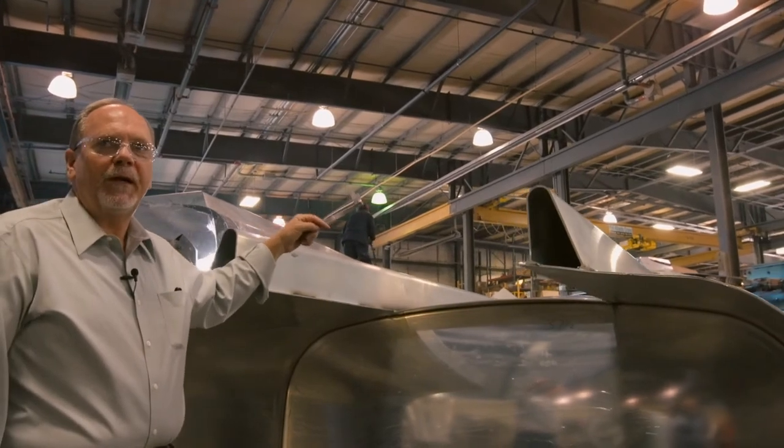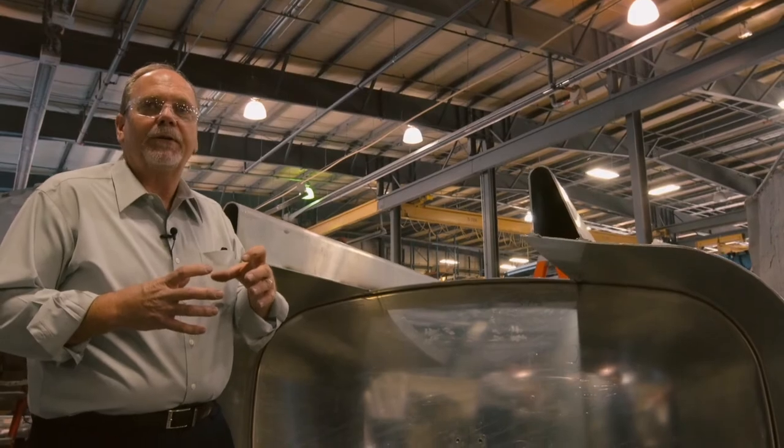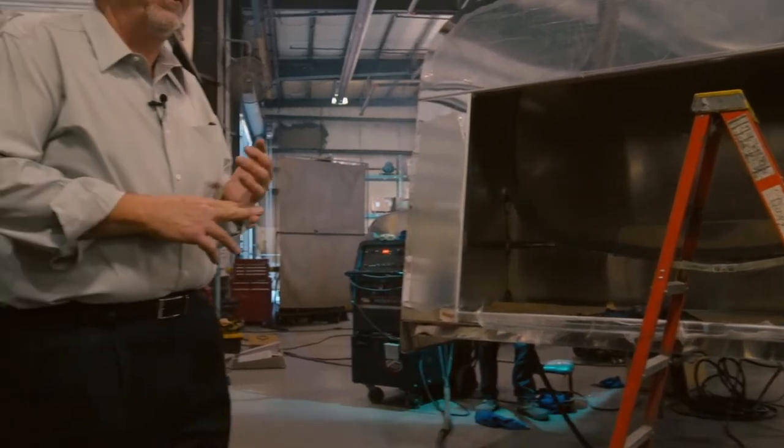Once it reaches finishing, the entire tank is buttoned up, closed up, all the openings on it, and it's given its maximum pressure, which for an oil tank is 5.5 pounds, and pressure tested. Also in this department, it'll be wired up to DOT specifications. Once that's complete, it goes to the cleaning process, and from there, either shipped to the customer or taken to our mounting department where it's mounted on a chassis, piped up, ready to service the customer.